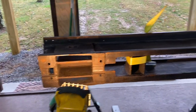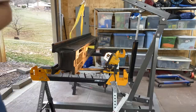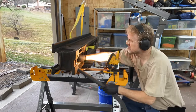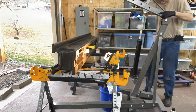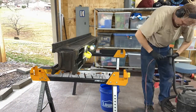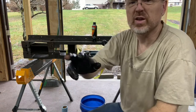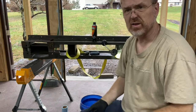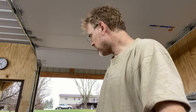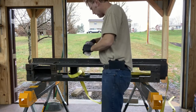I realize there are a couple pockets under each of the cross pieces that aren't open to the top, so I didn't get them cleaned up before. I'm going to just do a little bit there — it's like no end of getting the grease out. I'll probably hit it with some brake cleaner solvent, maybe some foaming engine degreaser, and see if I can get enough clean that I can slop some black paint up in there. I have work gloves to try to keep my hands from being quite so filthy, but they always just blow out. I'm going to see if I can smooth up just a few rough spots on the surface of this lathe bed before I start putting on some Bondo. Before I put the Bondo on, I'll do a final wipe with acetone.